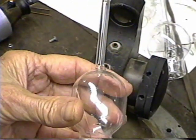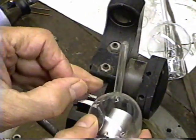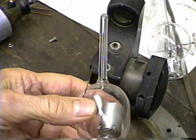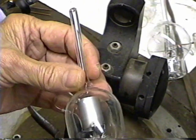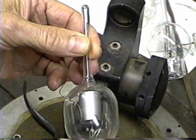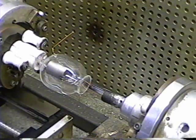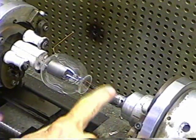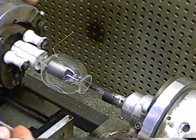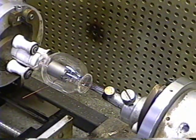This will fit, hopefully. Next thing to do is to seal it up. We have the tube mounted in the lathe. We took the base and mounted it in the wire holder and the envelope and mounted it in the other chuck. We can now rotate it and do whatever we need to do, and it holds the pieces exactly aligned. Trying to do that without the lathe would be quite a trick.